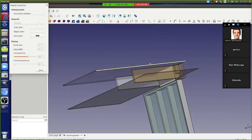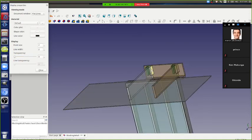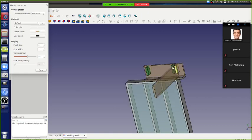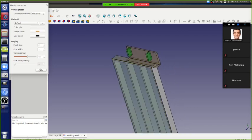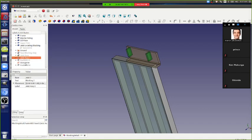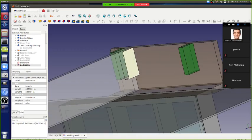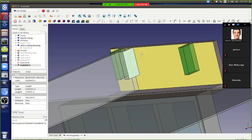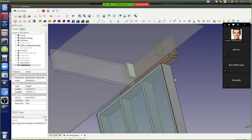So that's what's happening at the roof. There's your ceiling. In other words, all this blocking there, you don't need it. Well, you need these, they're connected here. These were the locating blockings. We do need these, because we need to locate the roof joists. We do not need this block here, because that was there just so we have the face blocking on the underside of the second floor. So now we've got a ceiling. That's going to be the ceiling on the second floor.